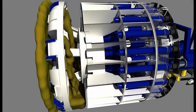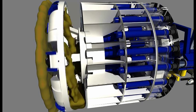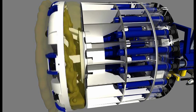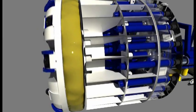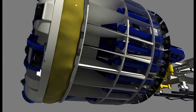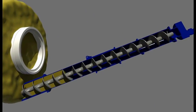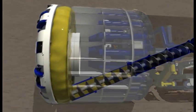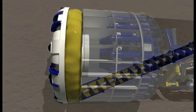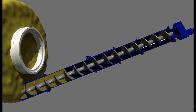During the excavation process, ground material or muck moves through the cutter head to a mixing chamber. Inside the chamber, the muck is pressurized and holds the tunnel face. The pressure differential between the chamber and the screw conveyor then draws the muck into the screw conveyor. As this happens, the muck's pressure is reduced from ground pressure to atmospheric pressure. The depth of the tunnel, the ground material, and the water level above the tunnel determine the ground pressure.